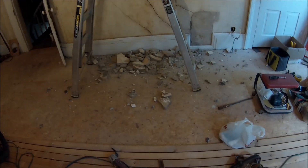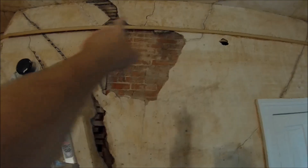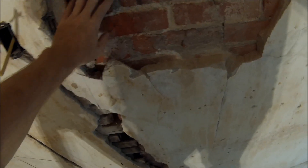I'm working on the plaster in this room. The plaster was coming off in some spots so I had to take out that big chunk right here — that's all of it on the floor. Some of it's quite thick, like an inch and a half in some areas. I'm going to either have to use some mortar or some Structolite to fill this in because it's pretty thick. A lot of it — you could fit your fingers back there — it was a gap, so it wasn't even touching in some spots.